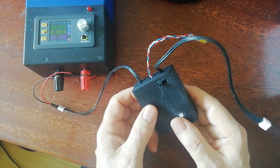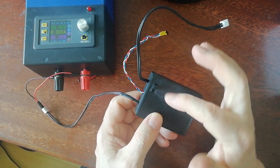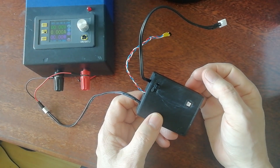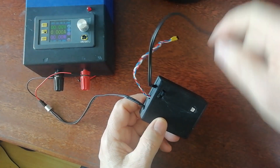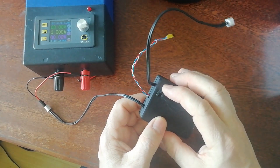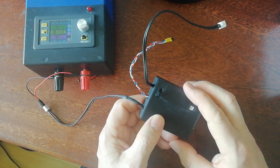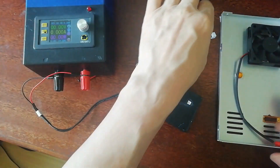There's an RGB LED which provides status information. This is the finished unit. It has a two-position switch at the back. The first position is bypass — meaning the electronics are off and redundant, not doing anything; it's just passing power straight through. The second position puts the electronics in the system.